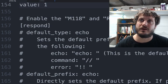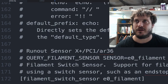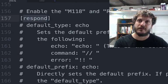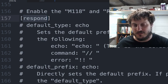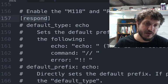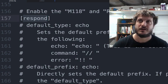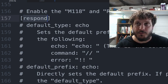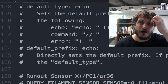I have the M118 set up here. I haven't really cleaned this up, but really the M118 is just this respond. That's all you put in there, and all I use this for is debugging, because similar to M117 that you print on the LCD screen, I want to print the same thing, whether it's printing, change filament, filament runout sensor, whatever it is. I want to make sure that I have that in the G-code terminal as well, so I can see that. And then you can do other stuff with it too. So you can do commands, you can do errors, but for now I just use it in the echo.